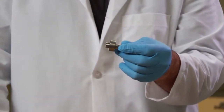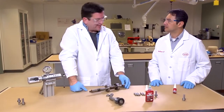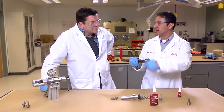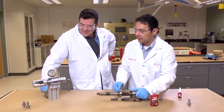That's all fine and well, but being a maintenance guy, I'm more concerned about taking things apart so I can fix it. If I come over here and you've got this stuff on there, I'm thinking I'm never going to get that bearing off. With this product, you can just apply pull force — it has very good rotational resistance, but if you pull it linearly, you can take it apart with regular tools. Why don't we try with that press we have there?